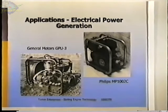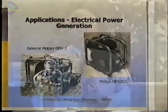The server that I use for my internet, for my web page, we had power go out for a couple of days last year, or the year before, I guess it was. And he told me that if he had a 500-watt generator, he could still be online because the phone lines were still up. His emergency power lasted for 20 minutes, and after that, he was down for 2 days. But he could have still serviced his customers with as little as 500 watts. The engine could have been hooked to a natural gas line in the basement. He could have gone down, started it, and had his electrical power and never missed a beat.